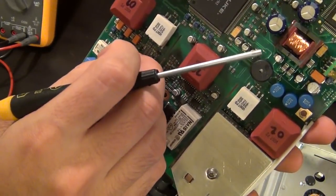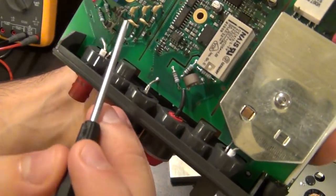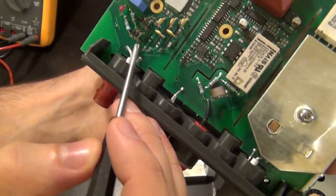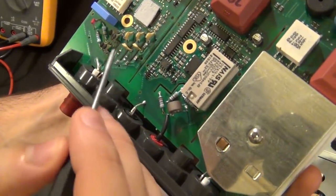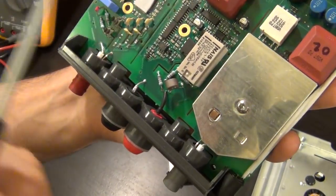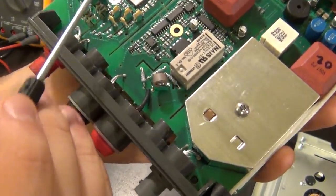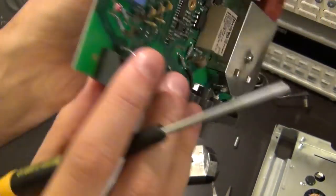So this one I don't believe is a high frequency ADC, but again the input is really neat. They have all these cutouts for the various protection and isolation. They have all these capacitors, which I'm sure you'd have to look at in detail to see exactly what they're doing, but they're all conditioning the signal. So let me see if I can, for example, trace out where everything is.